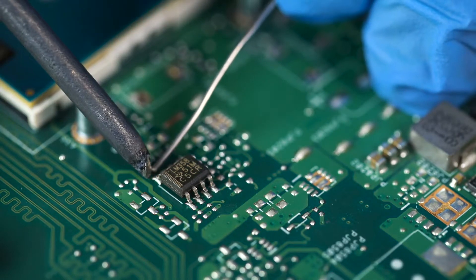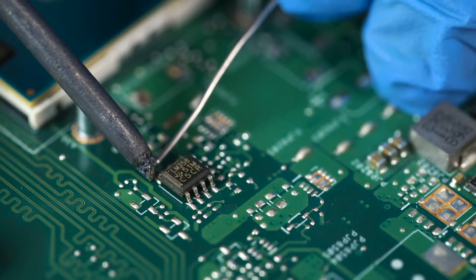To produce tens of a circuit board, there are a lot of rudimentary techniques that can be used. Sometimes hobbyists might even etch their own boards from a copper clad board. There are also printer-type tools that can route the connections. Those are fine for very low layer count PCBs and simple circuits. When it comes to mounting components, some people even use toaster ovens to melt the solder, or you could solder them by hand — probably the most simplistic approach, and usually sufficient at low quantities.